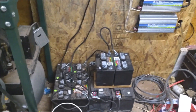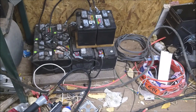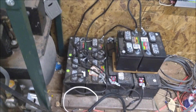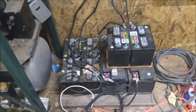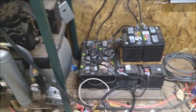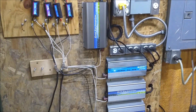I use cheap lawnmower batteries. I actually have two old car batteries that just weren't starting a car anymore, but most of it is cheap lawnmower batteries. For my purposes, they do what they're supposed to do — they just add some voltage control. I do not use batteries to store power. I want my power to go from the turbines to the inverters.